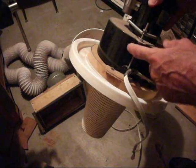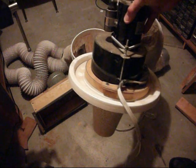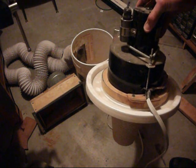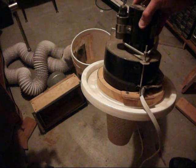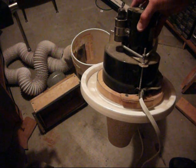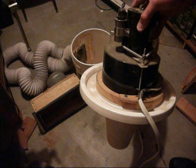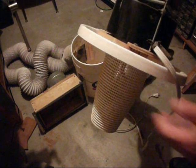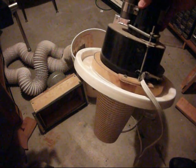The reason I'm using a radial blower like this is, first of all, I had it lying around. Secondly, radial blowers build up a lot of static pressure, so they can blow against a resistance really well — or in this case, suck against a resistance really well. So as the filter gets dirty, it still maintains some reasonable air flow.